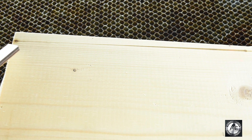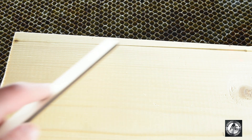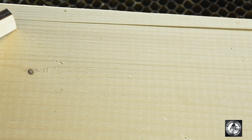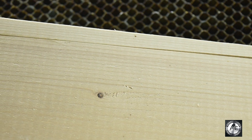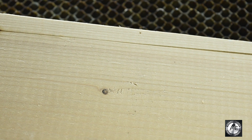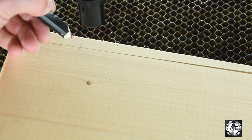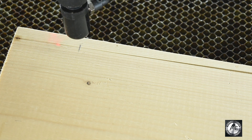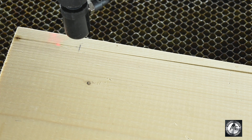Now that your line is drawn, you're going to go through here to look for where you have the tightest line. At the beginning it's pretty wide, and as we get down we get to a very narrow and clean line. You can see that that line is very narrow and clean — that is going to be our focal distance. Once you find where the narrowest part of your line test is, you're going to mark a line there, and then without moving the ramp, bring your nozzle head directly over the top of that mark and measure from the bottom of your nozzle head to the material — that will be your focal distance.